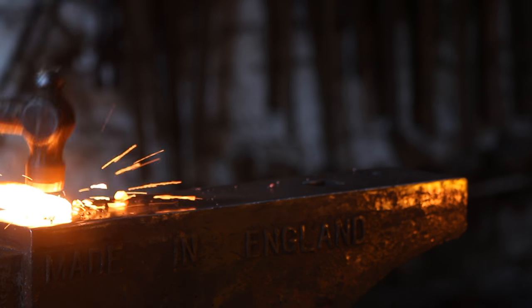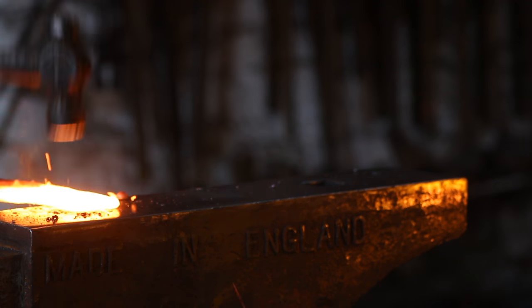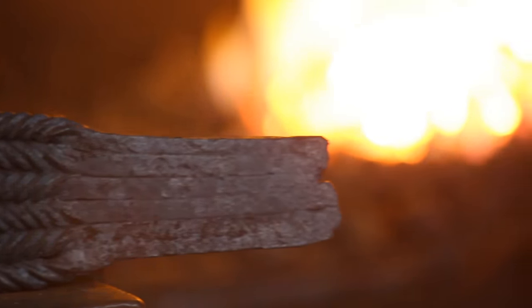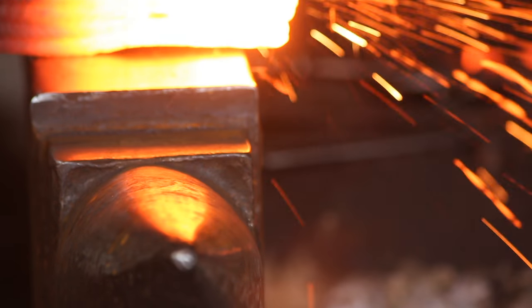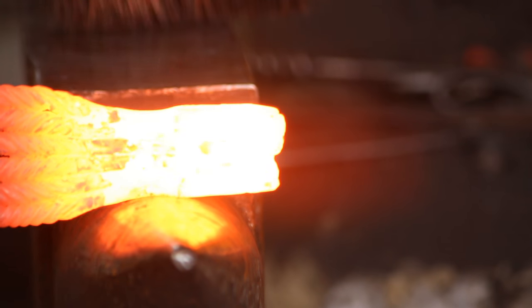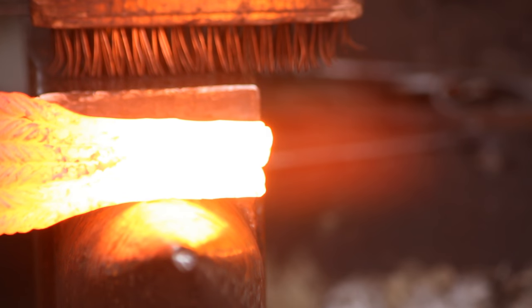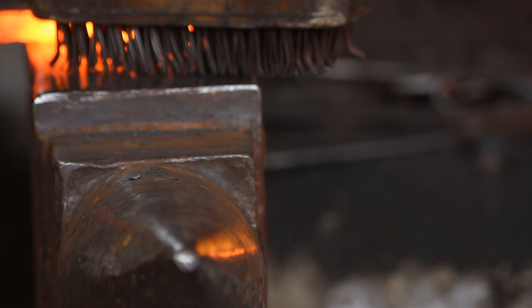I did do a tack on the tip of this as well - I didn't get this on camera. I also had camera problems because my camera died making this video, so I had to borrow my lovely girlfriend's camera to finish filming it. And here is the rough billet. There are some weld lines in there but I'm not bothered by them at all because they are fully welded. So at a good heat to save getting any delamination, we're going to head over to the bick and I'm using my shoe turning hammer with a radius, with a domed head on it, and we're just going to start drawing out these bits on the end - tabs maybe, a bit big for a tab. You want to get these down to about an inch and a quarter. The bick in combination with the rounding hammer makes short work of drawing this out.